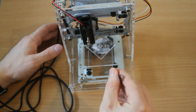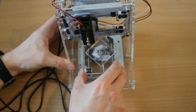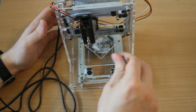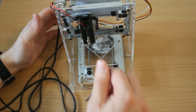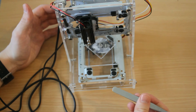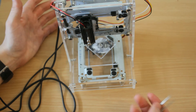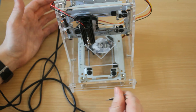The X and Y stages are done with stepper motors, moving along the X and Y axes, and they are in fact old DVD or CD drive steppers. So the area that you can engrave is only 38 by 38 millimeters — not very big. The quality is okay, not great but okay for the price, but it's really slow. It takes usually more than an hour to do a full 36 by 36 millimeter stamp-sized picture.